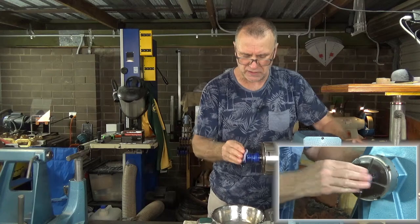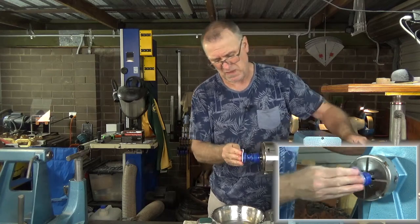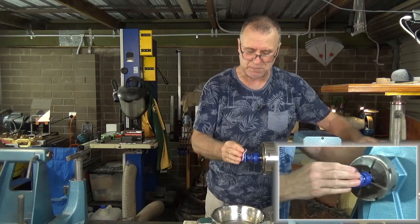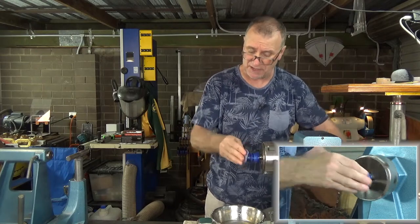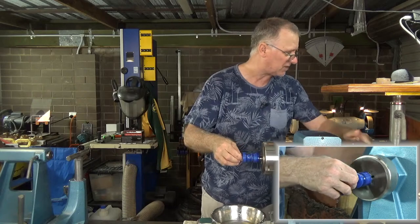Yeah, and the trick with the pin jaws, Amber, is that you'll find the pressure matters. You might split a couple of wooden handles, or you might split a shaving brush. I've done it many, many times in my earlier days, but I haven't done it in a long time. And you just learn where the pressure is, where you need to stop.